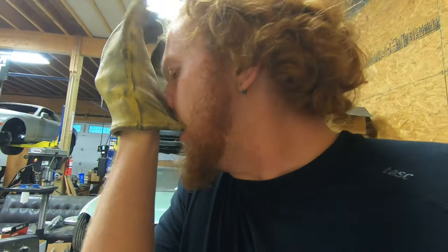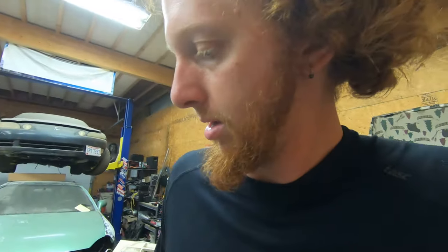I'll come in tomorrow morning, and at that point, if we still don't have the tap burnt the entire way out, I measured the depth that the tap is recessed in the block still, and it measures from the surface of the block 19 and some odd millimeters down to where the remnants of the tap are located. So with that in mind, what I may do if I can't get this last little bit of tap out will probably be to buy a Time-Sert kit and to Time-Sert the 6 holes that will fasten the head flange down to this block.